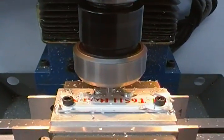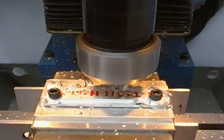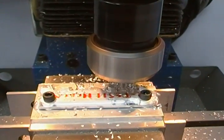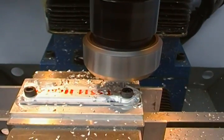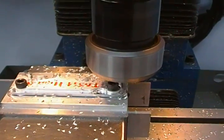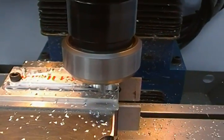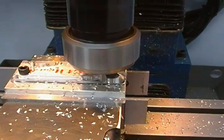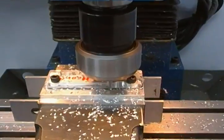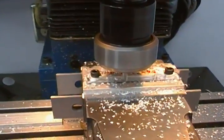The mill itself has a one-horsepower spindle and it is a belt drive with a maximum spindle speed of about 5200 RPM. The mill has all ball screws on all axes, but is simply running stepper motors — not servos. They did make a bigger version of this same mill with servos, and if you're looking for a good CNC mill, I can highly recommend it.